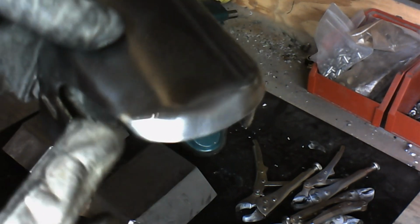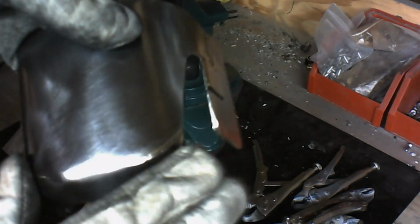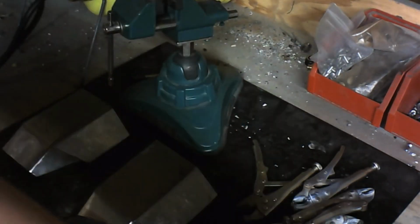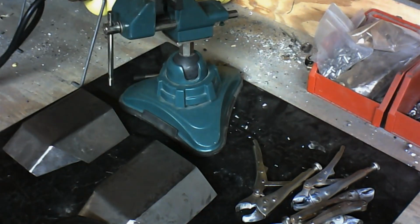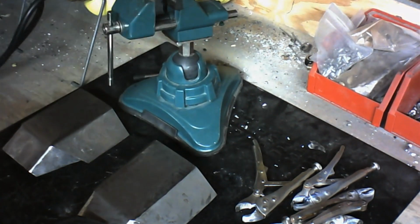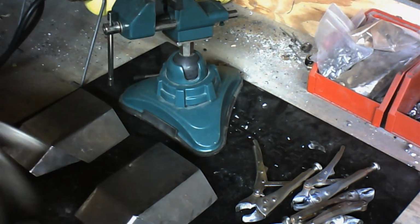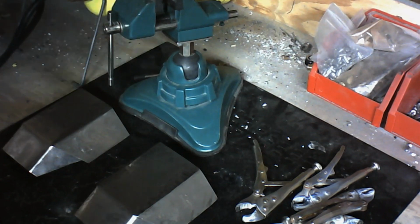You'll see this kind of bronze colored area. You'll also see it around the joints here on the wing. And on the inside, more notably, you'll see it. That is actually brazed, where the metal has been welded together with a brazing rod. Brazing is not difficult. The most important part of it, as with any part of armor production, is patience and knowing the right temperature and how you actually apply the braze to the heated metal, and knowing the tools.